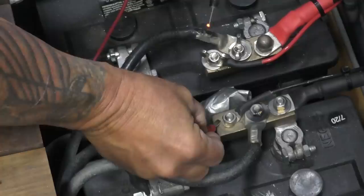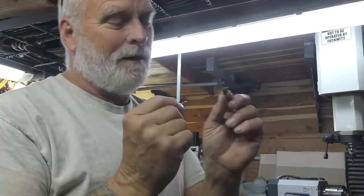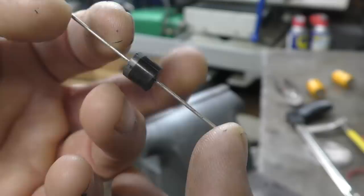It's warm now but still working - ah, this one died. So you can kill them and they die in the closed position. I've tested three of them and two died, just became pieces of wire. But that's hundreds of amps. When the coil collapses it's going to send a lot of voltage back the wrong direction - we want to take that voltage and send it back across the coil, not to the switch. So we're going to wire this across the coil with the band toward the positive.